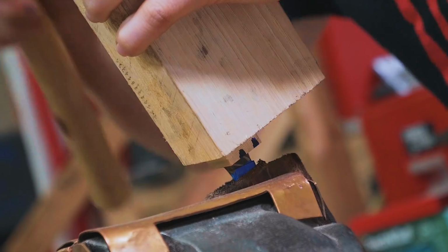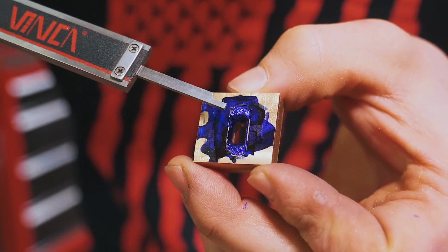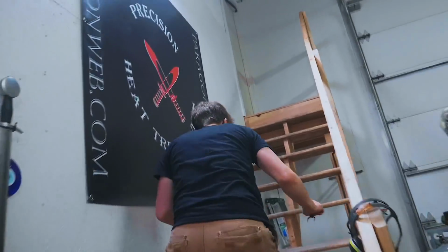You're expecting something? So with a little bit of that beautiful blue potion, when we hit our fork onto the piece of bronze, it shines up the areas where there's contact. So it means I can go back upstairs and know exactly what we've got to remove. And again, the question is asked, where's Will? Because he does this way better than me.